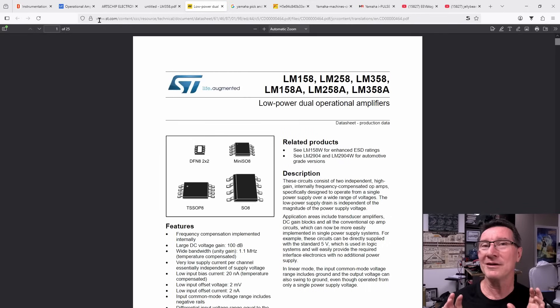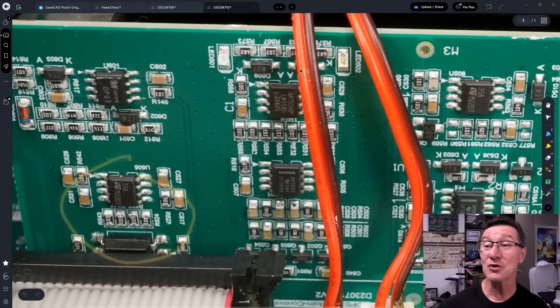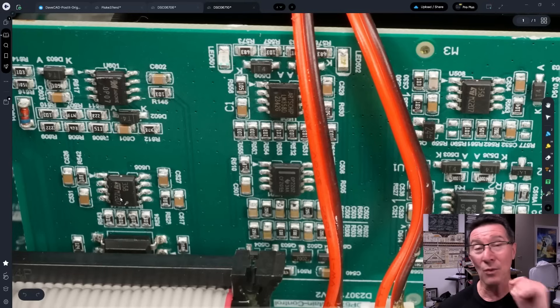You pick it because there are tons of different manufacturers available, so you're guaranteed to get this part forever — also longevity of production; they've been selling it for 50 years, they're not going to suddenly stop. You don't really care too much about the specs. You don't need high bandwidth, high precision, low offset, low noise, and all the other bells and whistles. There are literally thousands of different types of op-amps to pick from. If you're doing a design and you care which brand of LM358, or which brand of jellybean component — be it a 7805 voltage regulator or an LM339 comparator — if you care because one has slightly lower offset voltage than the other, then you're doing your design wrong. Your design shouldn't care.